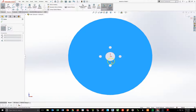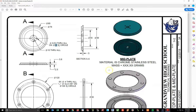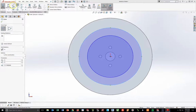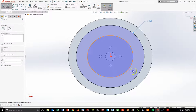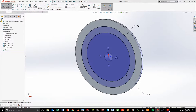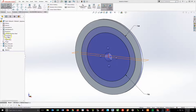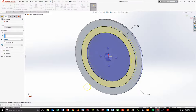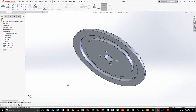I'm going to draw two circles — one and then one slightly bigger. I'll dimension those two circles: 55 and 69. So the outside circle at 69 and the inside circle at 55. Then I'm going to cut up a distance of 3 millimeters — going to Features > Extruded Cut, putting in 3 millimeters, and hitting check. Now I have that recess cut in there.